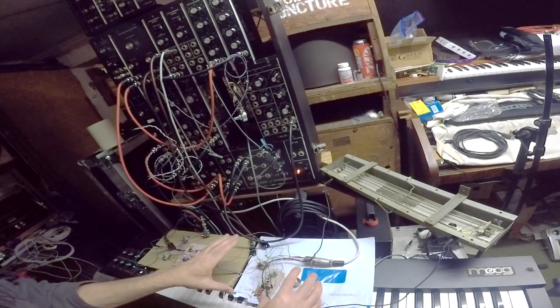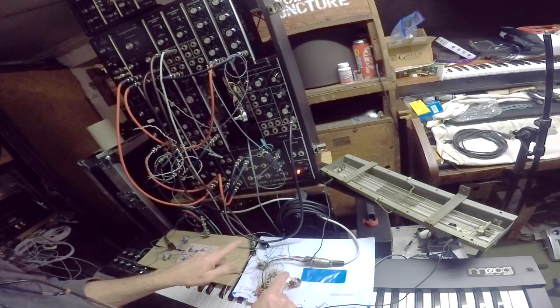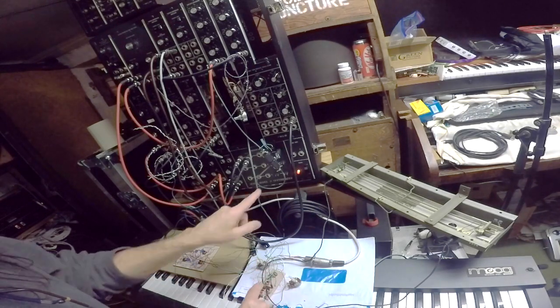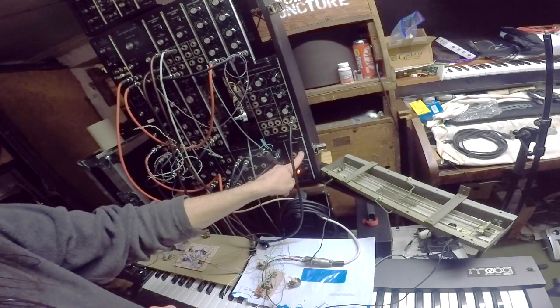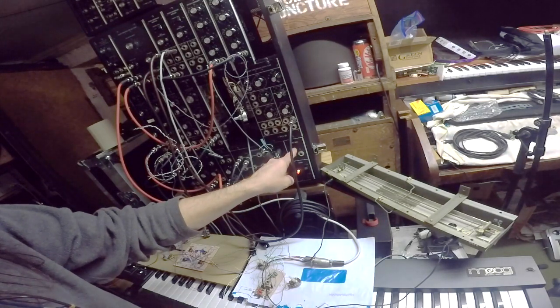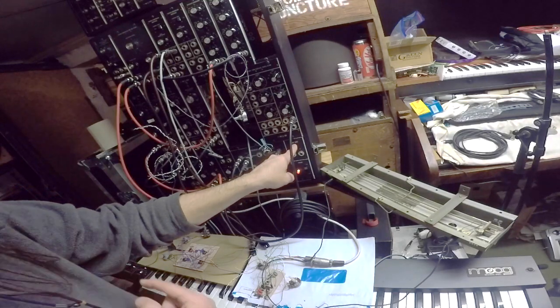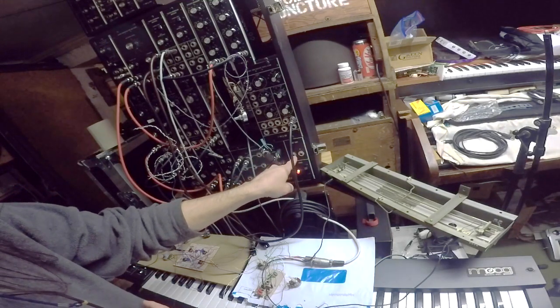There are quite a few things I can look into. I'm going to put the controls and sockets for the reverb where the trunk lines are, because I don't use trunk lines. I'll have to drill a hole here for a smaller dual tandem pot, and I'll be using these as the input and the outputs.